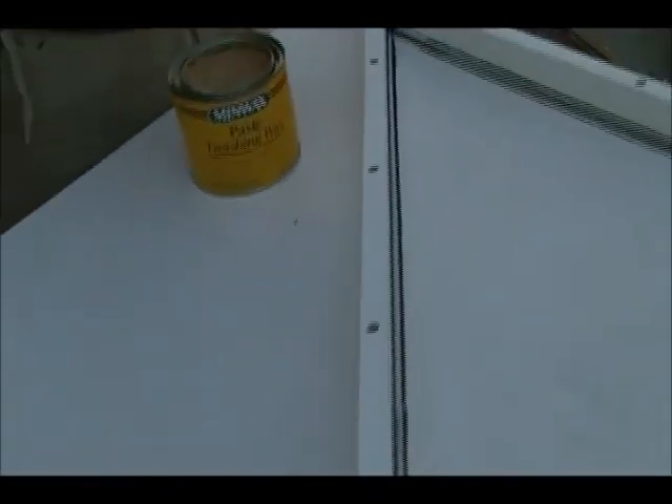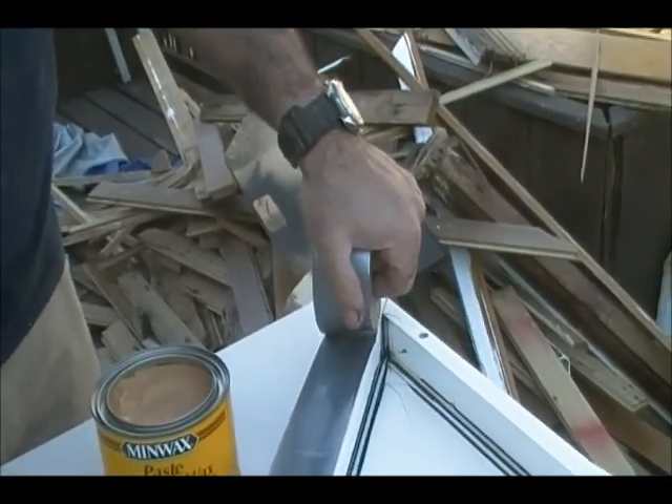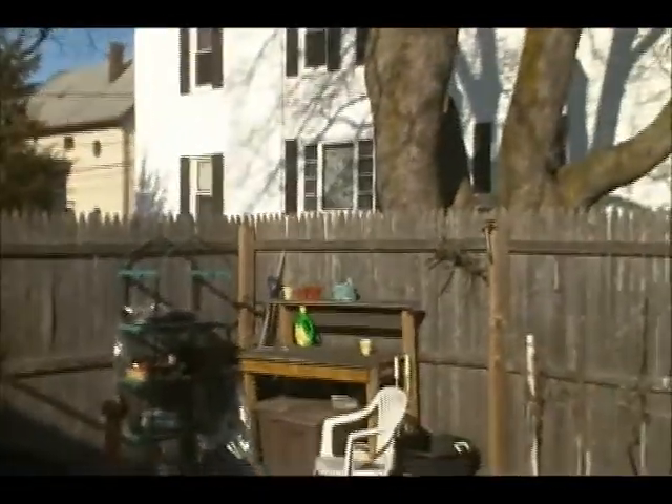After that, I want to take this duct tape and place it over the top here like that. This doesn't do anything but when I'm done screeding I peel it back and I can get at my screw holes — because if I fill those up with concrete, getting the form off is gonna be tough. I've seen some guys use hot glue to hot glue the form right here. Essentially that's just a demo and I'll come back and trim all this. We're almost done with the kitchen, this is the last couple of things to do.